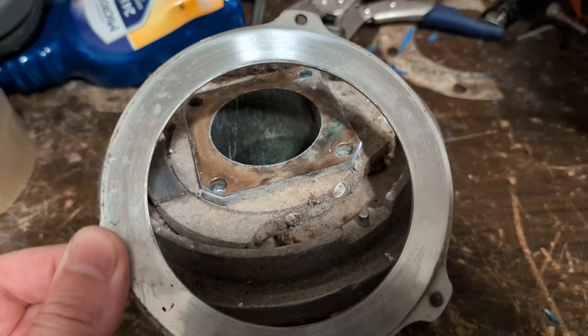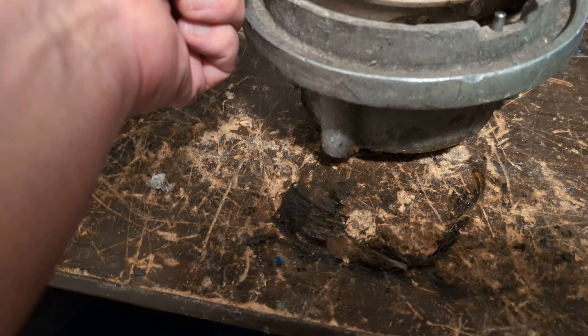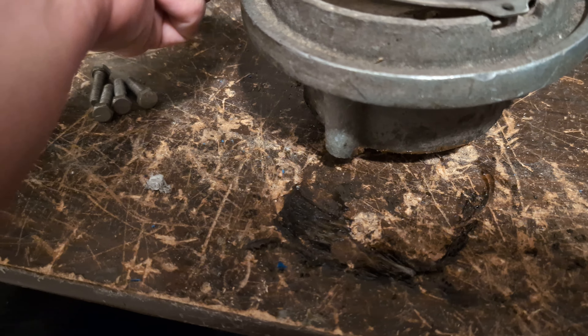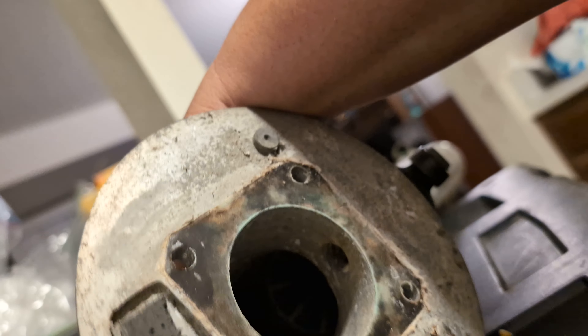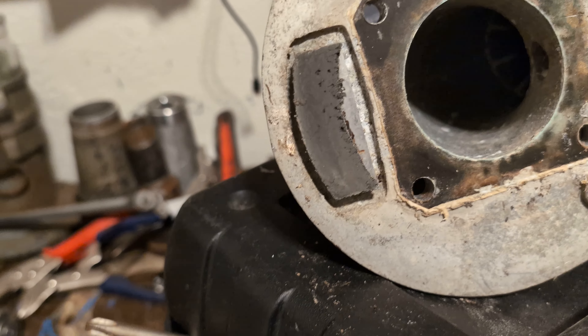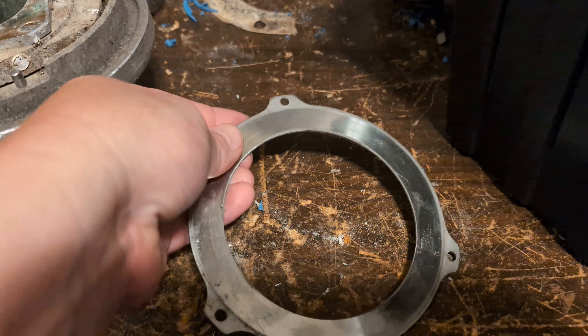As you can see, this is the bearing and brake assembly of a P150 big gun. This is a brake disc right here. This is what it uses to slow down the gun when you adjust the brake and it applies tension. The way it works is there's a pad here on the base, and then on this actual elbow — what they call the elbow — there's another pad there.